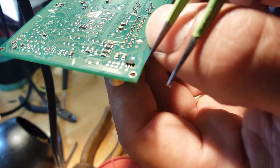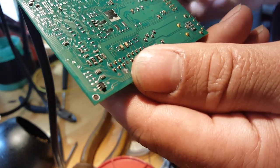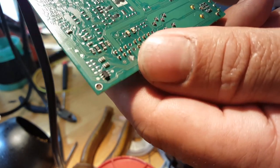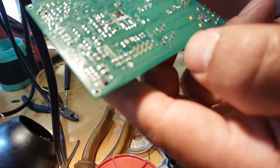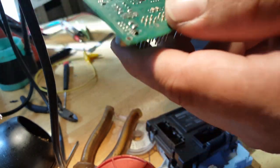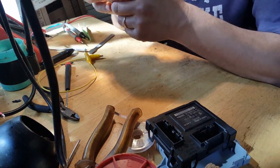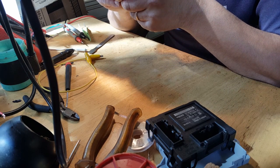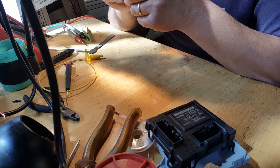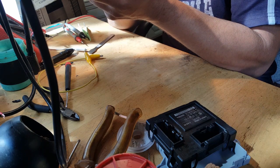So, what happened is: this first leg here — the leg is still in there, but the pad — which is the area of the PCB where the pin is supposed to solder — the pad is pretty much gone. It's nothing there. So what I'm going to do is run a wire, or actually it might be a little bit of pad still there that I'll still be able to use to just solder this again.